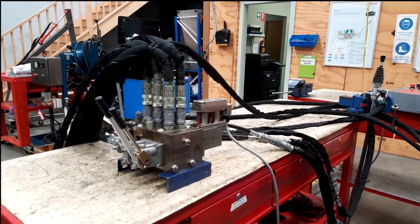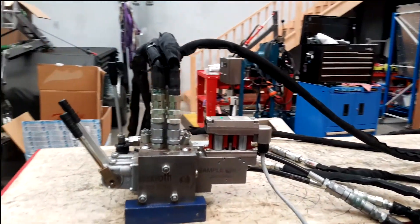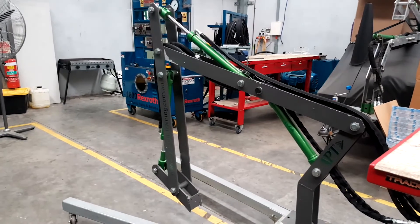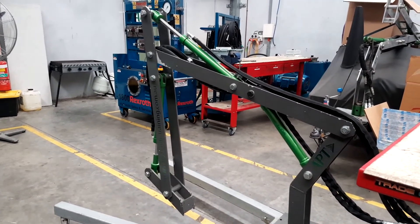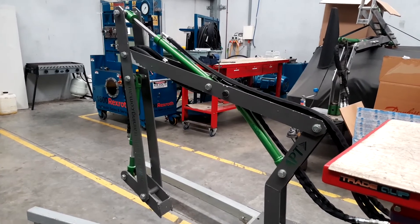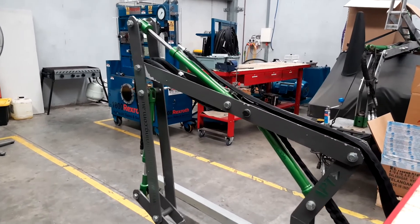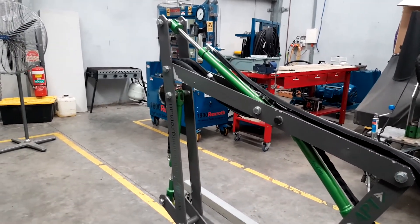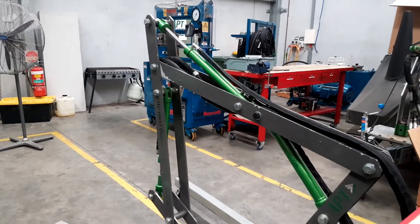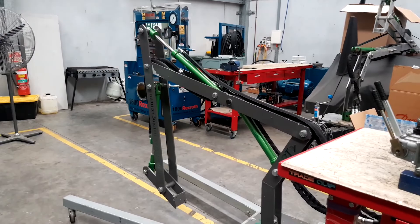The trick with these systems is that we need to make sure that while the pump's running, we dissipate pressure, or we park the machine in a safe spot to ensure there's no stored pressure before doing any operations or maintenance on it. It's particularly important for maintainers to understand that while that boom or bucket is sitting in that state, it's generating pressure in the hoses — and if we take that hose off, we might expose ourselves to a hazardous situation.